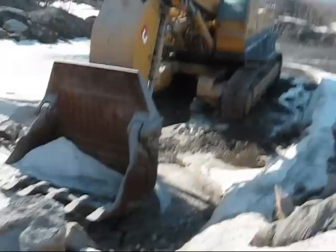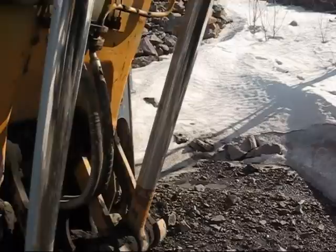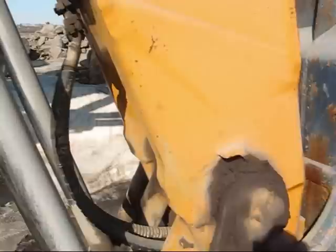I'm going to take you and show you around the machine a little bit. The shovel bull clam on the PC-1000 is 8 cubic yards. Here's your bull clam right here, your lip on the back and your front jaw that basically opens and closes. Just like all Komatsu front shovels, there are two cylinders to curl your bucket. The linkage is also unique on the older 1000 — you see your two big knuckle pieces, kind of like what you'd find on a standard mass excavator, one on each side that basically curls the bucket in and out. These two lines run inside the bucket to power your bull clam cylinders, which open and close the clam bucket.